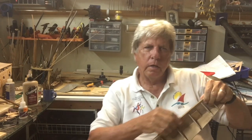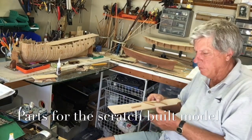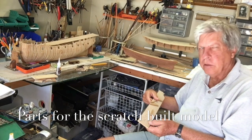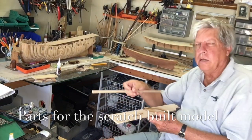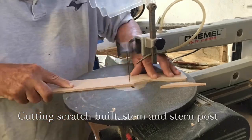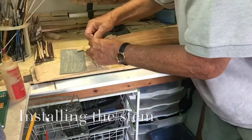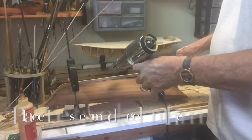Instead I've decided to use a solid piece from my stock to make this part, and I'm using some juniper locally available to make up the stern post, the stem, the rudder, and the keel itself. Out to the outside shop we went, cut the various pieces out, cleaned them up and then fitted them to the model to make sure that everything fit perfectly, and then glued and pinned the stem to the model. From there we then tried to bend the keel into place.